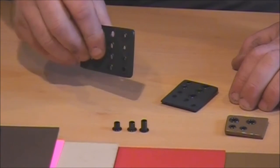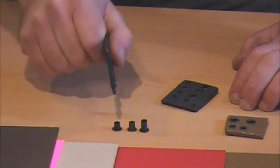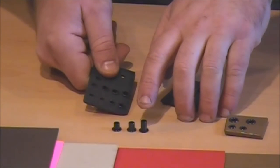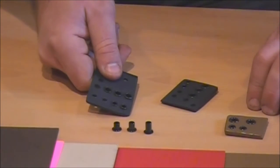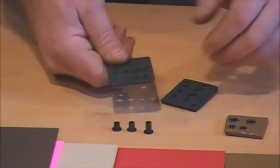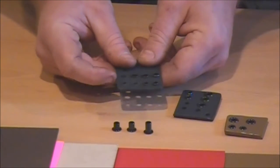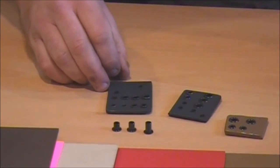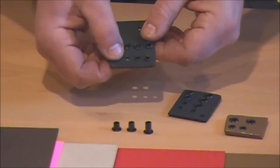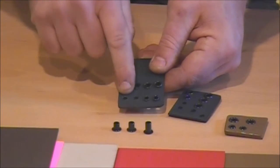However, I've found that all of the rivets are quite capable of riveting anything thinner than their specification. And for preference, to be honest, I always use the one that's designed for riveting 2 3mm pieces together. You get a slightly different effect, you get a better swell on them. In the 3/16 size, they've actually got a specific rivet for doing 60 thou, which they don't do in the 1/4 inch. So this size should use this thickness rivet.